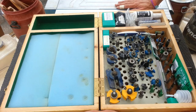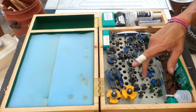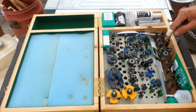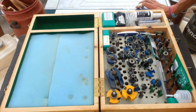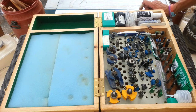Now we've got them clean and ready for storage. I like to store mine vertically in boards with either a half or a quarter inch diameter hole to fit the shanks in. They're not in any particular order — just randomly placed to make as much space as possible. When I first made this box I drilled all the holes neatly apart, but ended up losing a lot of storage. If you're making something new, put the holes in as close as you possibly dare. Basically it just means they don't clank into each other — you don't want your individual cutters rolling around in a drawer, because carbide cutting edges are very brittle and if they hit each other you will chip and damage them.